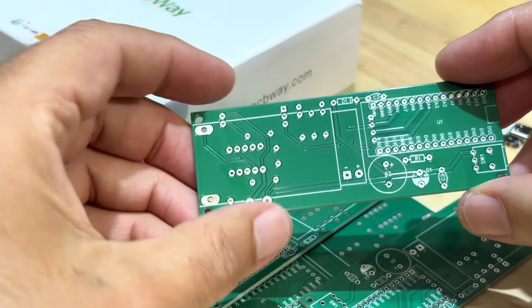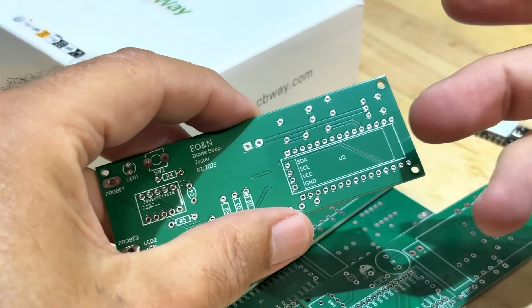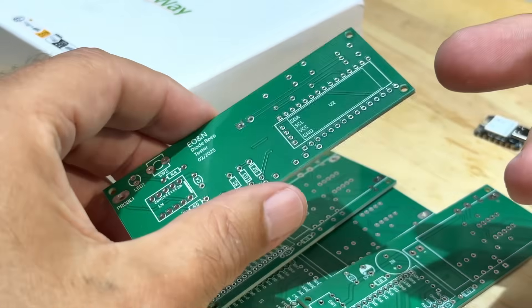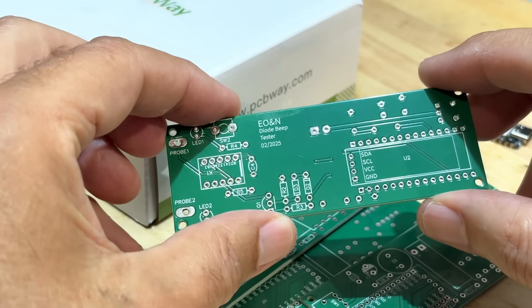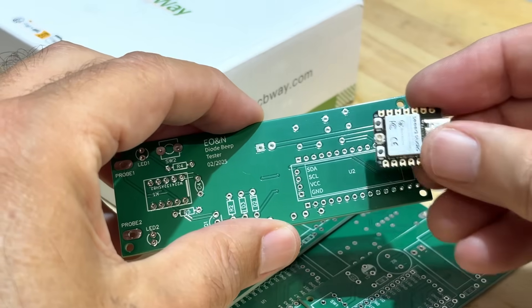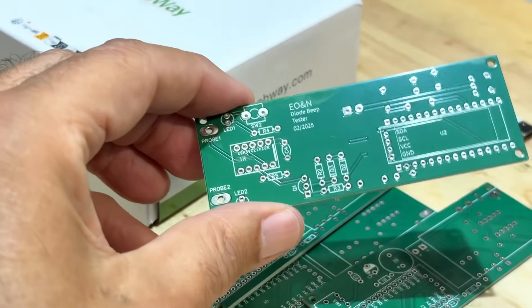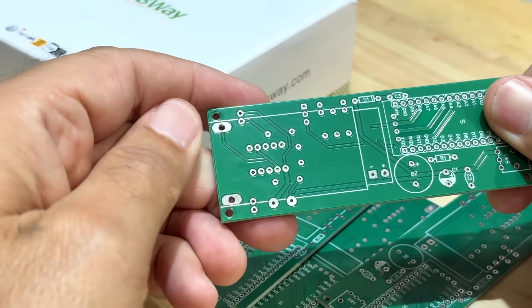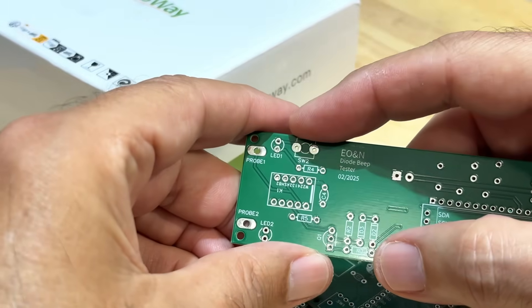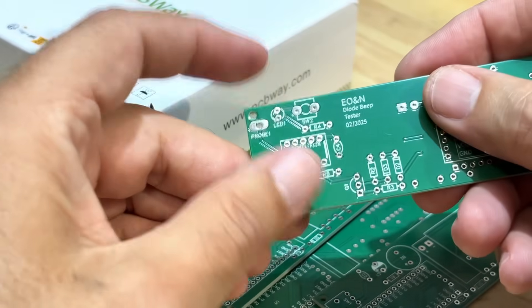The other issue was the display. Some of you said, rightly so, that you don't really need a display. Need? No. But I like a display - and if you create different beeps and different frequencies to identify the type of PN junction, you don't need a display at all. That said, I've given it more thought and I'm going to use the display on the new version because it is narrow and will fit nicely on the reverse side of the board. I'll probably use that side button as an interrupt to bring it out of sleep mode.